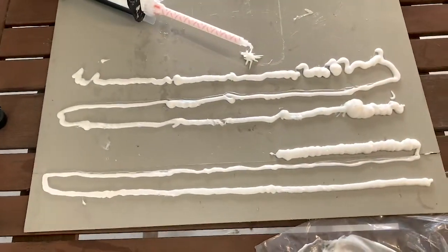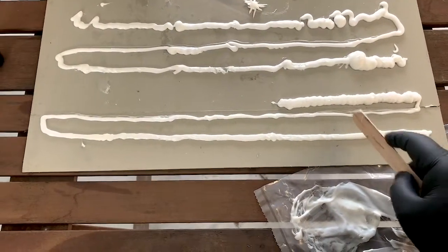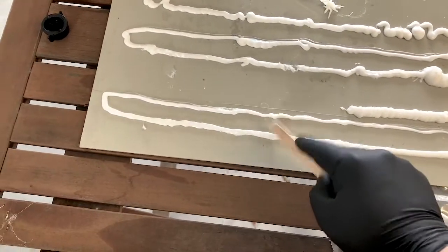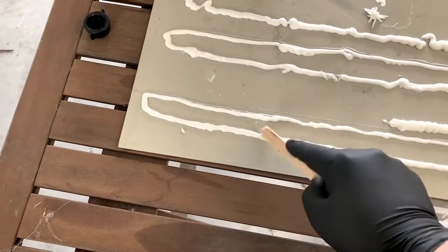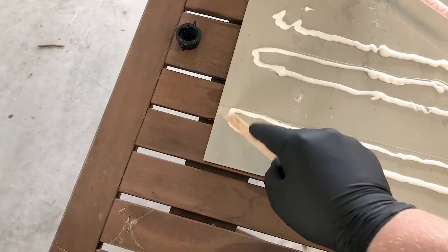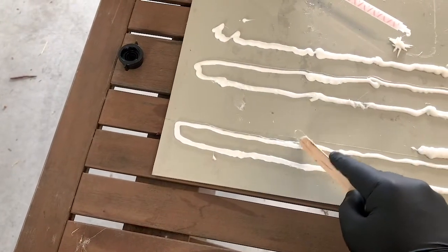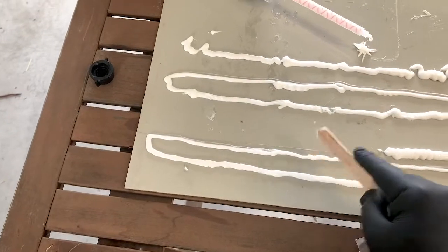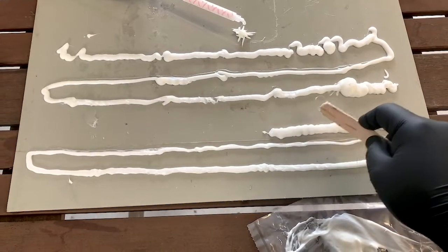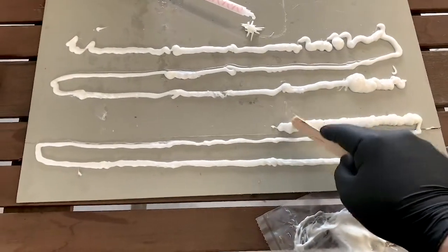Okay, so we're a further 5 minutes in. This is actually now starting to sound crispy. As we move along, starting to get softer. It is a touch patchy, but it is all curing. Now we're starting to get quite soft in the thinner mass. And over here in the bigger, thicker mass, where it's going to generate more heat and accelerate the cure, that's all well and truly on its way.